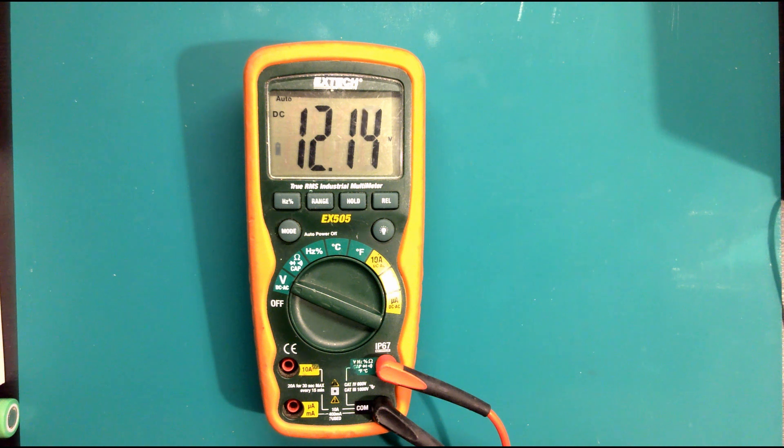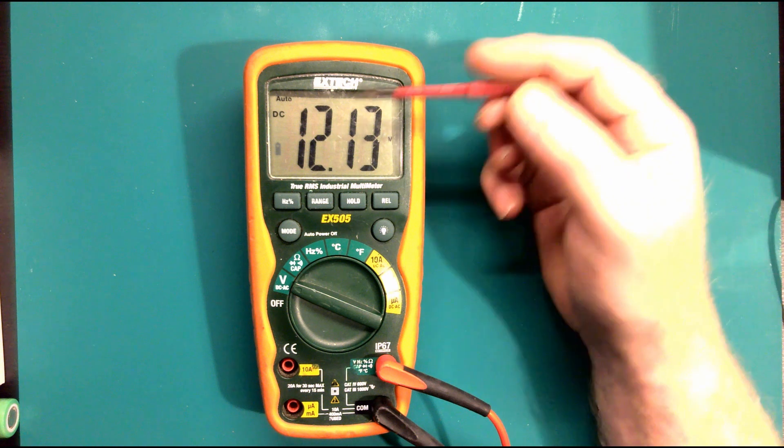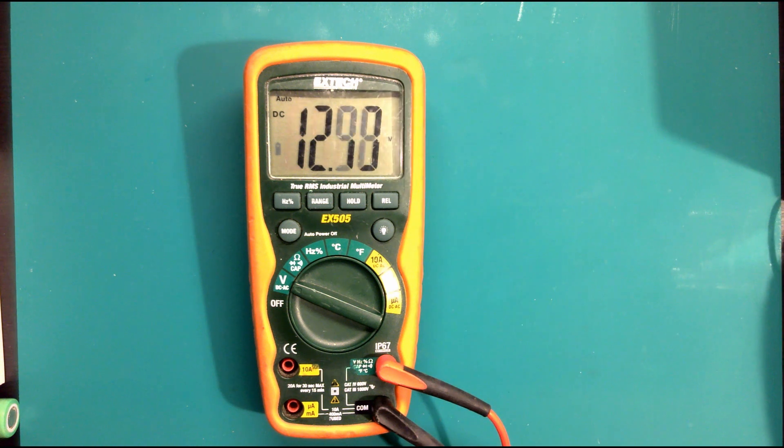Always keep an eye on your display, see what you're doing, and don't go on complete autopilot. On the range we're in auto - if I creep up a little bit you can see it's actually keeping up a little bit better on this meter. I'll take it to about 13V and then hit range so now I'm in manual range. You can see it's a tad quicker. Sometimes if you've got a power supply that's playing up and the loads are dipping, on manual range you'll see it quicker.